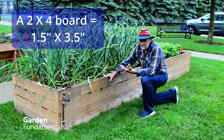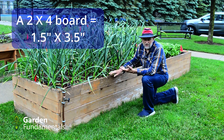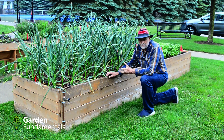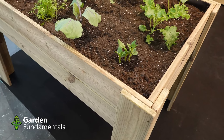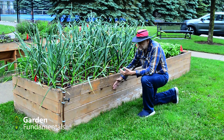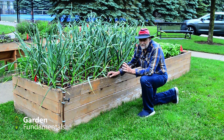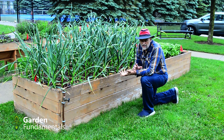It does take a bit of skill to put together. You can make them one, two, three, four, even ten boards high if you want. Personally I like them a little lower. What I see a lot of people doing when making wooden raised beds is using wood that's too thin. Don't use anything less than one and a half inches thick. Thinner boards are less expensive but they're too soft — the soil will push them out in the middle and they'll get all warped. Four-inch boards is probably overkill, but two-inch boards is the right choice. It's a good compromise between cost and longevity.